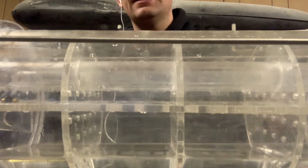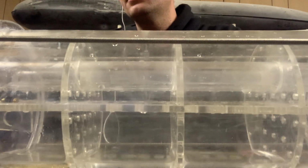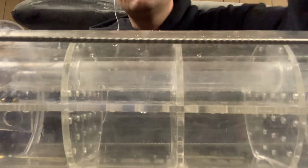You'll be at the surface now, and the last little bit of water in there gradually releases itself, and then your boat will be back at its true trim. The beauty of this system is that because you don't have a forward and reverse pump, you don't have to worry about how much juice you're using, so it's a much more economical way of doing it, and you'll get a much longer running time on your submarine.